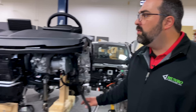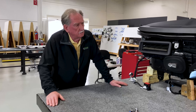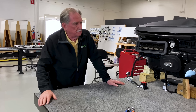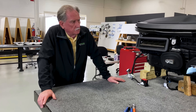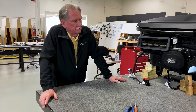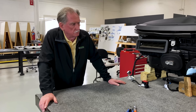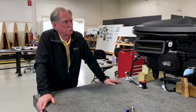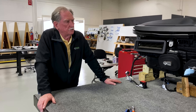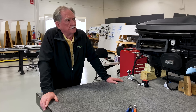One of the main reasons they may have that access panel so big is because they need to get the steering column componentry attached, and usually that takes somebody on the inside and somebody on the outside. So having a large area to stick your hand in is a good place to have a break in the IP — I think it's also an assembly aid.